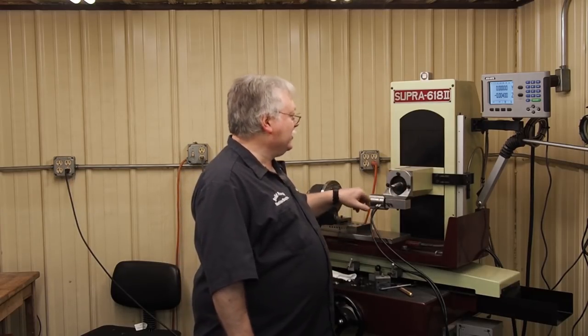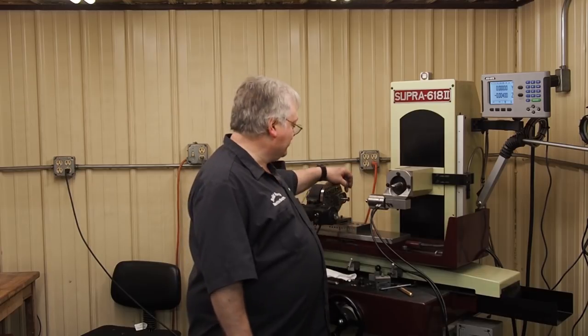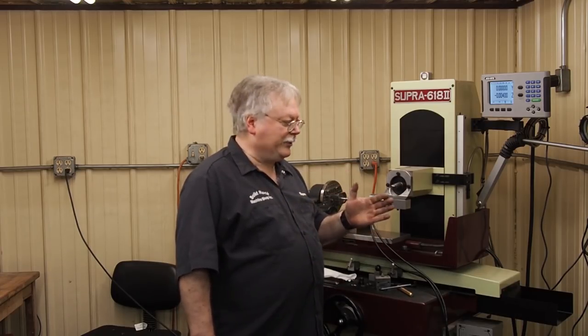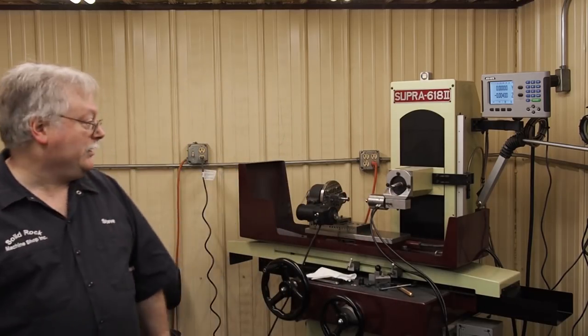So anyways, it takes a while to get 4 thousandths, or 8 thousandths what we should have took off, out of a small hole like that, because you get a lot of that wheel time to cut. It's wanting to flex on you. And you gotta just give it plenty of time to clean up.